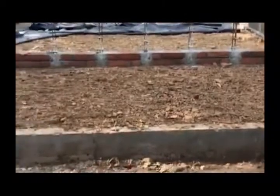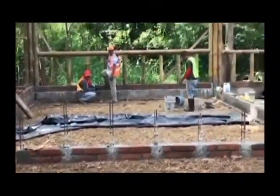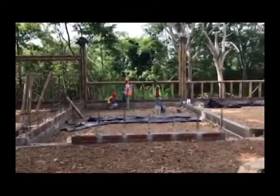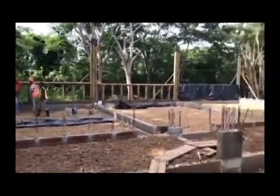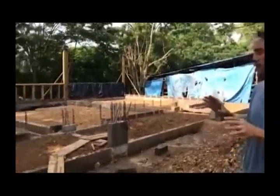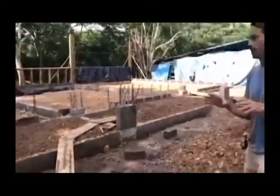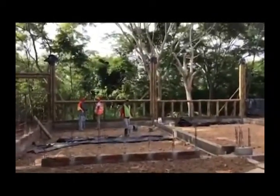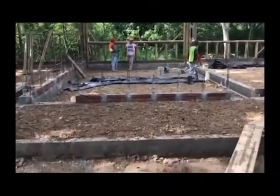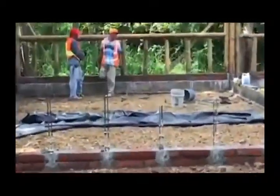So we have to fill it up as we're lifting the structure up out of the ground, getting the final floor and bringing the bamboo off the ground so it's not in contact with it. We also have to bring in a lot of fill. What's amazing, and you don't see it by eye, as I mentioned in one of the other videos, is that the front level to the back side has a difference of 50 centimeters. 50 centimeters is a little bit more than 1.5 feet.